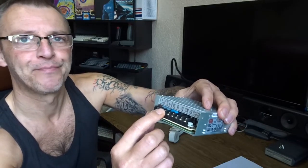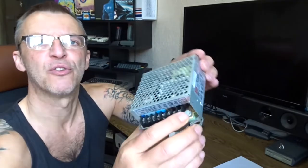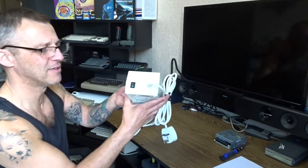Live, neutral, earth - standard mains AC. You've got your NC, then V3 which is minus 12 volts, plus V2 which is your plus 12 volts, then plus 5 volts, and there's an adjuster to tweak your 5 volts. Basically dead simple. All the Amiga chaps out there will know what this is - there's always a power switch with a cable sticking out the front, and on the back you've got cable feeds to the computer.